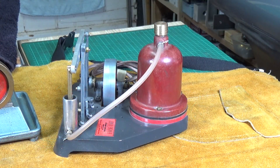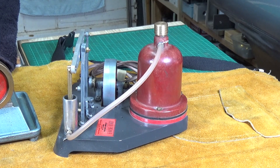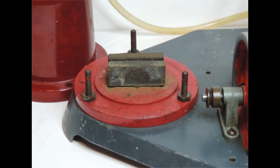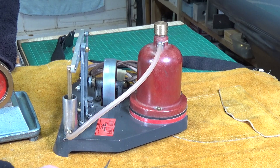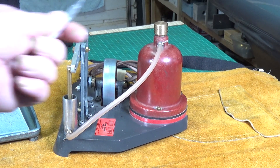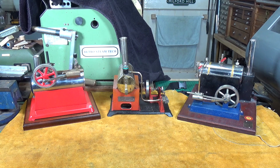The boiler is unusual because it's not metal - it's a fibreglass type of construction. The heating element on this is very strange. Basically what you've got are two carbon blocks with a small gap between them. The beauty of this heating element is it's absolutely dead safe because it relies on the conductivity of the water to allow current to flow and generate heat. If there's no water in the boiler, even if you put power on it nothing will happen - it won't draw any current, it won't heat up. Quite an amazing sort of heater - I've never seen the like in any other model steam engine.